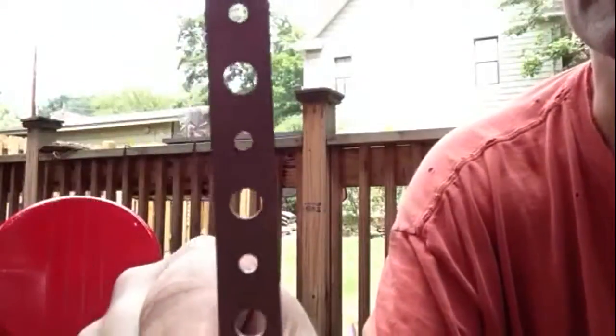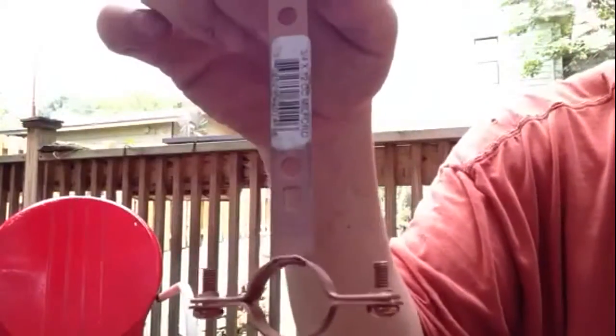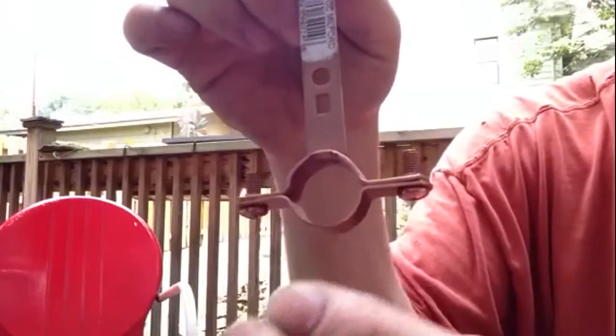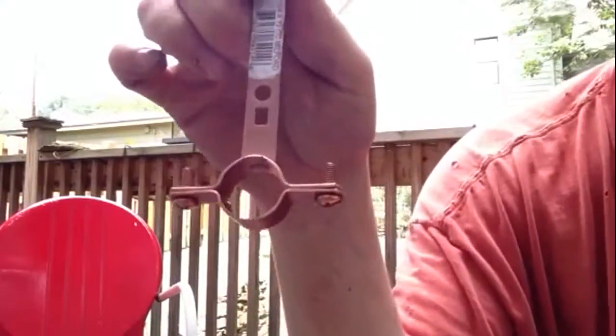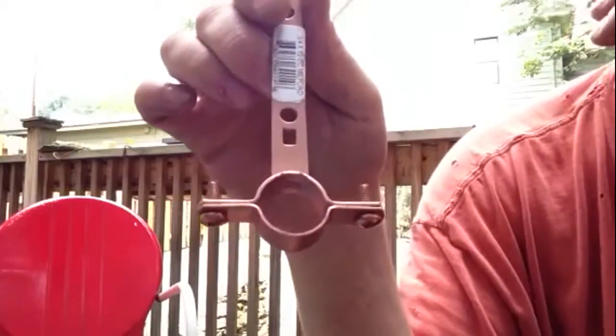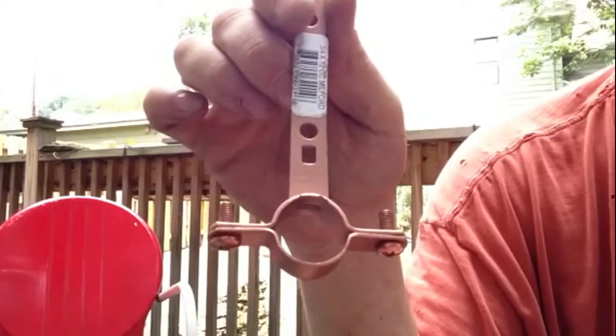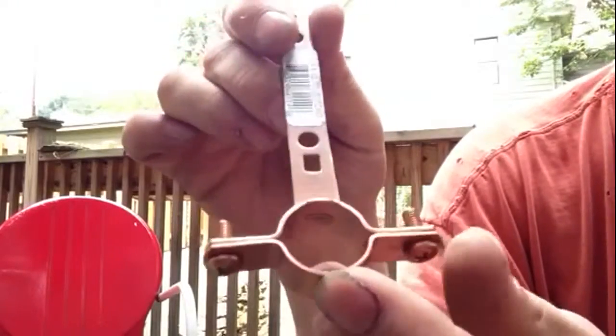The other option is kind of like a strap hanger, and you hang the strap from your joist. I like to use these whenever you have a lot of obstacles — you've got to drop the pipe a little lower, pull it up a little higher. You've got to go over your heating pipes or whatever it may be, and you don't have a straight shot that's up against the joists. This is what I would use.